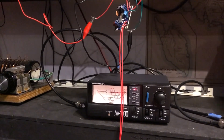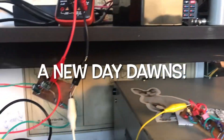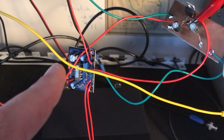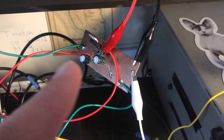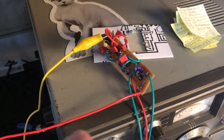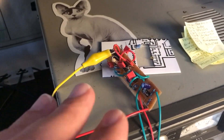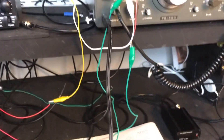Tomorrow we'll check the filter circuit, make sure it's wired correctly, and see if it's actually working as a narrow band CW filter. This is our test setup - we've got our filtered supply, that's our speaker, the amplifier module which we know is working, along with our 9-volt regulator powering the audio amplifier. Now we've incorporated the filter, which has a split rail - 12 volts applied, plus and minus 6 volts approximately. This is the part of the circuit I'm most concerned about - the Veroboard construction is very messy, I haven't laid it out very cleverly, and I'm a little bit worried it's not going to work.